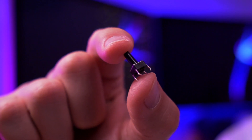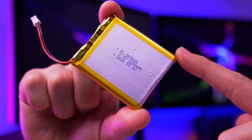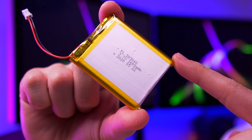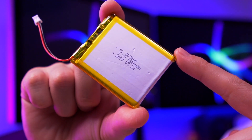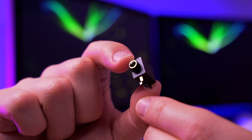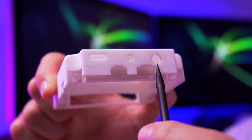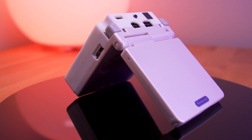We'll also need this momentary switch in order to activate pairing mode on the Bluetooth module. Next is the battery. Since there is quite a bit more workable space, I'll be using a much larger one. This 1600 mAh battery, which is a little over double the capacity of the original, will give us more than enough playtime. One of the key missing features on the SP was the standard audio jack. Unfortunately, we were unable to add this feature for this video since we had ordered the wrong 3.5mm jack. The shell has an opening that will accommodate this feature once we have sourced an appropriate part. The last item is the wireless charging module — and really, this is where it all started. The path to this mod began with wireless charging, and now here we are adding so much more capability.